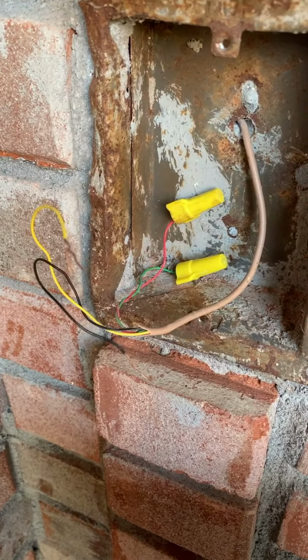And I'm going to put a relay in between the Ring doorbell and these wires so that it just closes the loop and does not send power to the Chime doorbell, which is what it's doing when you push the button on the Nutone station here. So hang with me for a second. I'll show you what I'm going to do.